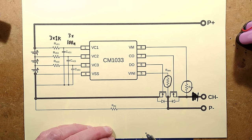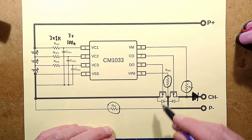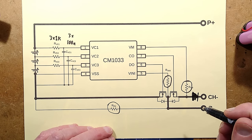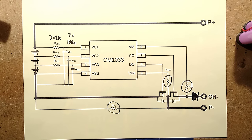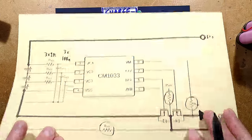There are the three cells, each with its own 1K resistor - 3 times 1K - and I'll guess those are probably 100 nanofarad capacitors, 3 times 100 nano. They're just there to provide basic filtering so it gets a nice stable voltage reference.